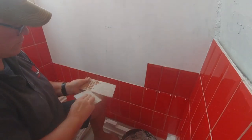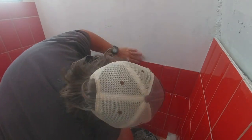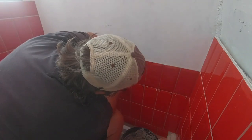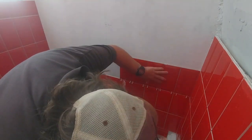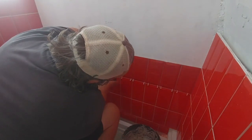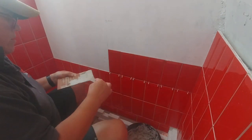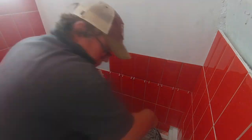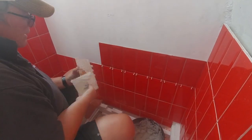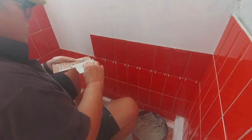I'm using three millimeter tile spacers, which I put in sideways so I can pull them out quite easily. I'm never sure whether you're supposed to use them as crosses and leave them in, but I prefer to take them out so the grout will go in at the right thickness. I'm using showerproof tile glue, as it is a shower and we want to make sure it doesn't fall off the wall. I'm hoping there's not enough flex in the bow to ping tiles off, but the bulkheads aren't connected to the hull so there shouldn't be any movement anyway — time will tell.